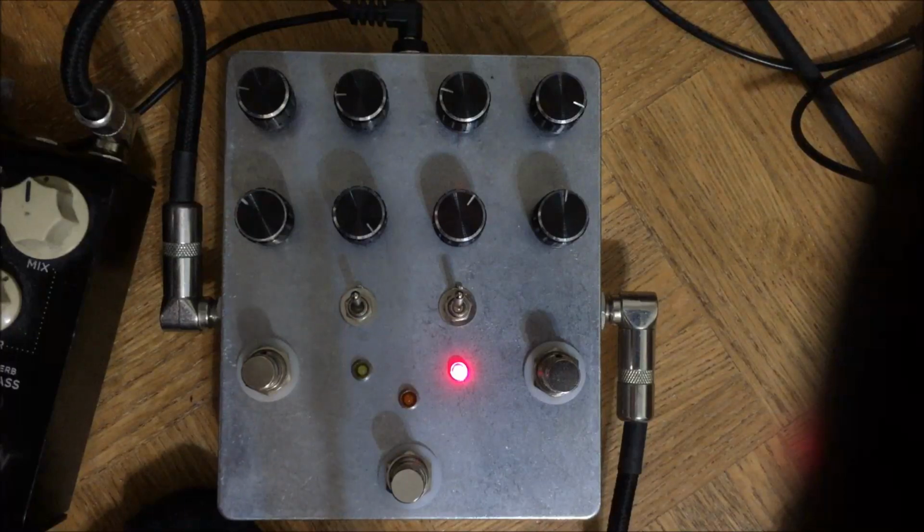So this is essentially a digital delay that's voiced to be like the old style analog bucket brigade delays, and somewhere between that and vintage tape echo effects. It's based around a chip called the PT2399, which a lot of boutique builders use. I know that Brian Wampler used it in a few of his earlier delay designs. I don't know if he still uses them for the newer ones he does, but it's a pretty cool circuit. I basically took a circuit built around that chip and just expanded, as much as I could, every feature that I could figure out how to do into one box.